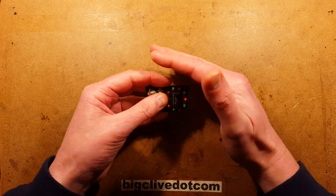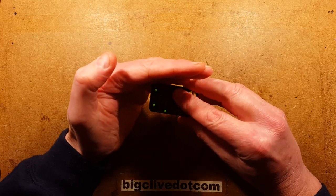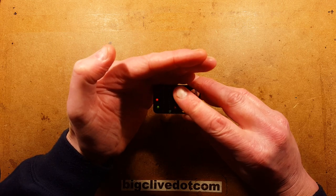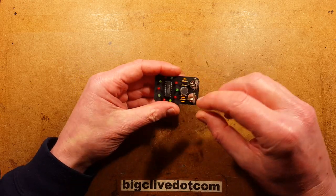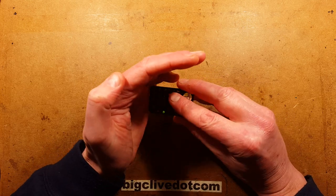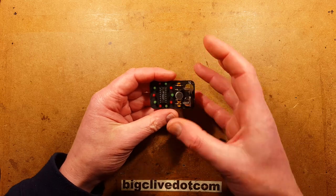And I don't know if you're going to see this, but some of the LEDs are glowing very dimly. Because it's a 4017, until it resets completely in one cycle, a random number of LEDs will light. But the idea is that on the beat of the music, an LED would step about randomly. And it's not very bright.